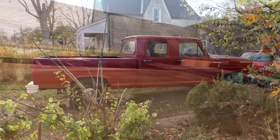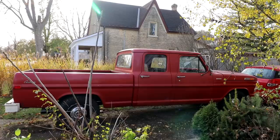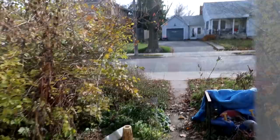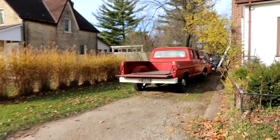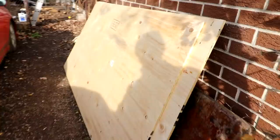I'm wondering if I should drive the truck and go get the plywood for the roof - I need some drip edge and all that kind of stuff. I should take a trip to Home Hardware and get all my supplies. It is the next day and it is the most beautiful day - sunny, warm t-shirt weather. Last night I finished the day by going to the hardware store and got three sheets of plywood in the truck, plus the drip edge flashing that goes along the edge of the roofing. Here's two of my pieces of plywood - half inch thick or 12 millimeters. And I did a lot of tarring up here.